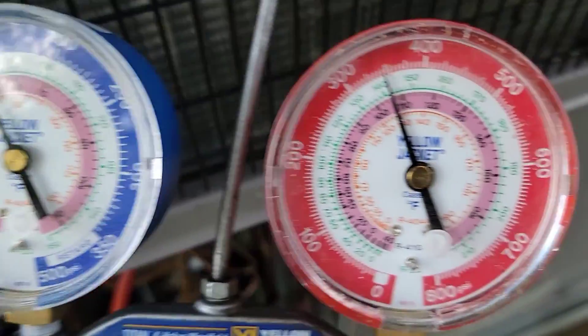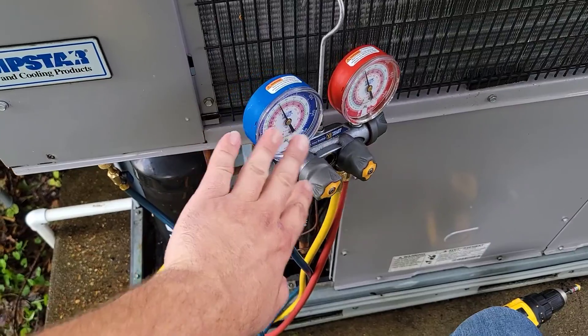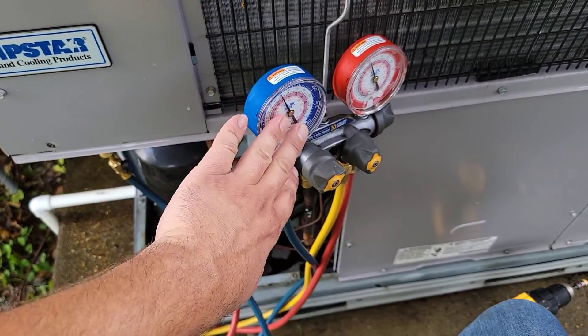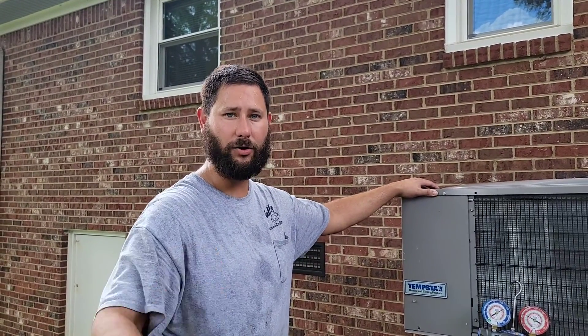Units back on. Low side pressure is 140, high side pressure is 345. If you want to learn more about charging equipment using superheat and subcooling, I'll put a link in the description. Check out my playlist, HVAC Tips for Technicians — I've got a bunch of videos from my experience in the field as a technician. Let me know in the comments if you've used the coil gun and what your experience was. Hope you enjoyed today's video and learned something. You've been watching HVAC Tips for Technicians — I'm Tad, and I'll keep you cool if you let me.